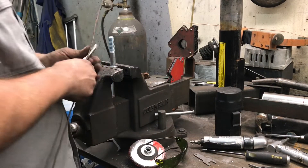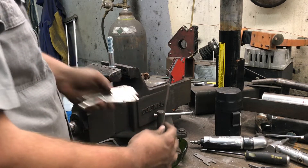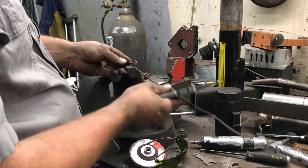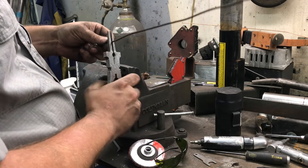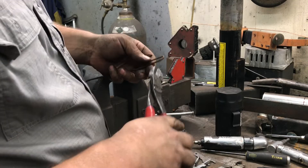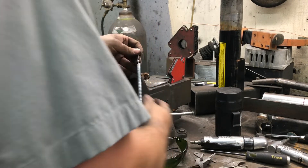I've got a three-quarter bolt locked in the vise and some number nine tie wire — or snare man's wire as I've referred to it. Give that a little half wrap, form a little loop. A three-quarter bolt makes this radius fit on top of a barrel lid real nice. Your first one is kind of feel-it-out — what feels good. I use my first one as a template so I know where I need to grab the next one. Any old pair of pliers with a reasonably thin jaw — 90 degrees, 180. Leave about a half-inch tag, cut it off, grab one of your springs, thread it on there, crimp it closed. There's one of your mounts.